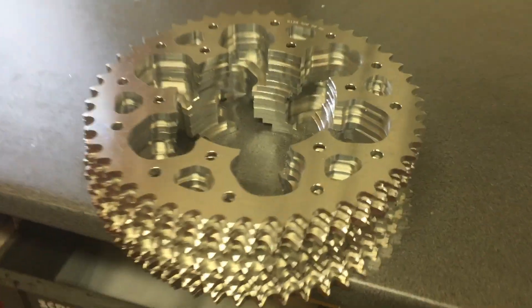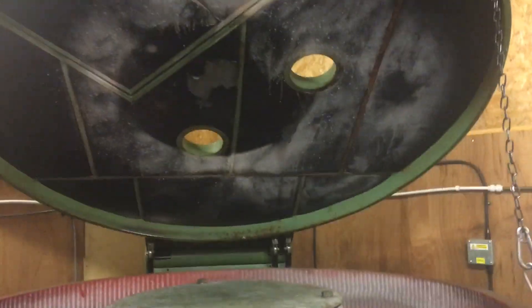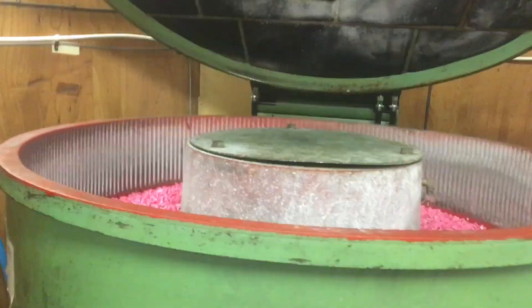We need to get the front sprockets hung up in here — very noisy, obviously. What's that doing in there? It's tumbling. So as the sprockets come to us with sharp edges, they get chucked in there and the stones take off the sharp edges.